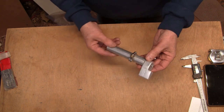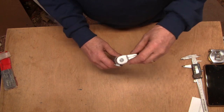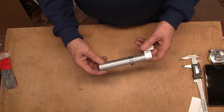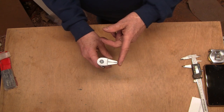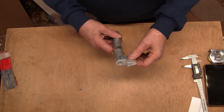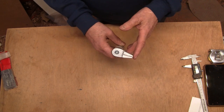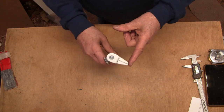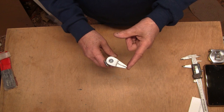The other question that really makes me hesitate is, are you going to make them and sell them? Well, there's a lot of complications with that. Not all tool posts are the same size, and not all banjos are the same. I made this specifically to fit my banjo. If I made one for another Laguna I know how to do it, but for another manufacturer I would have to do a lot of research to know where to put this, because I want it to always be able to touch the ring that I'm turning.